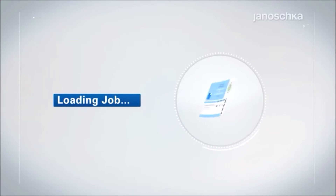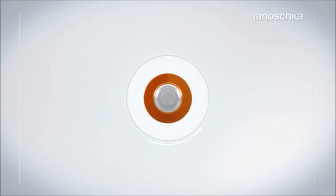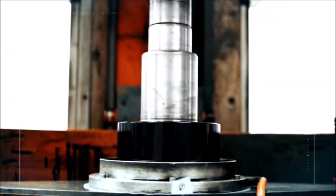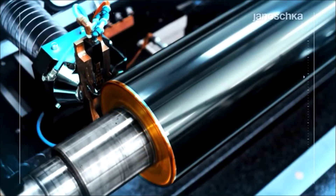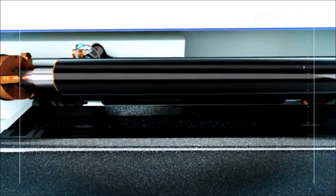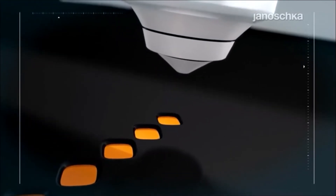The etching technology is known as the first illustration technique for rotary rotogravure printing. This conventional technology is characterized by its very high engraving resolution, which makes it ideal for the highly demanding requirements of security printing. Before starting the laser process, an etching resist is coated onto the whole copper cylinder. This layer protects the cylinder against the ferric chloride during the etching. Its thickness may vary from 3 microns to 5 microns depending on the requested etching depth. The laser process reproduces the design onto the etching resist by removing it; the copper remains unaffected by this production step.